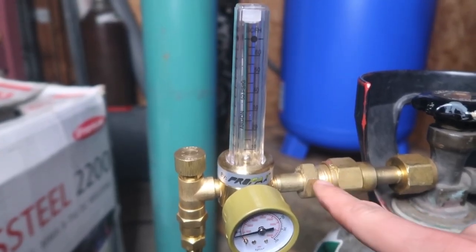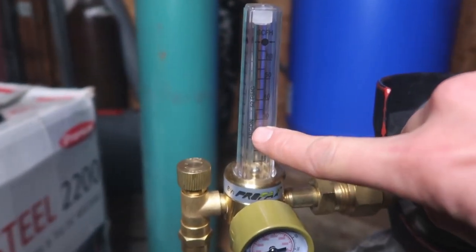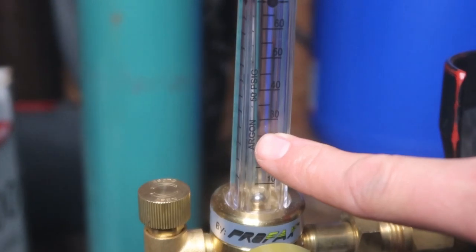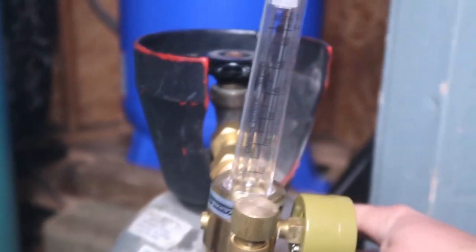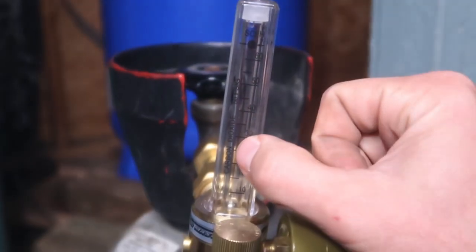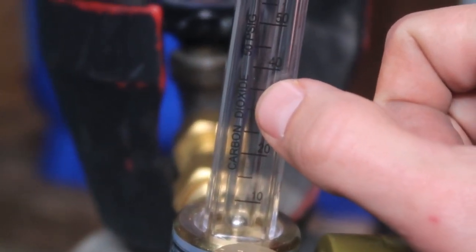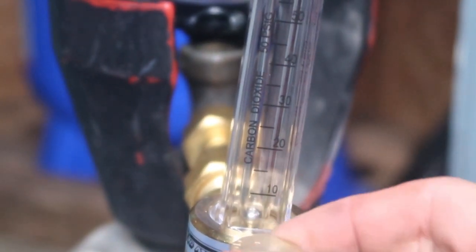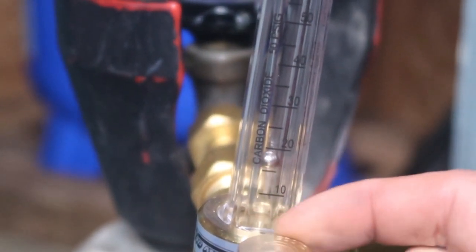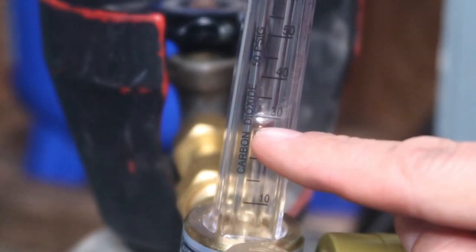I have this fitting to go to my standard 580. When you're looking at a flow meter, it shows argon or argon CO2, so you've got to rotate the flow meter around — on the back side there's CO2. If I rotate this around, you can see carbon dioxide. This is where you want to check your flow rate when you're setting your gas mix. I'm going to hit purge on the machine and then set my flow around 30 CFH on the carbon dioxide.